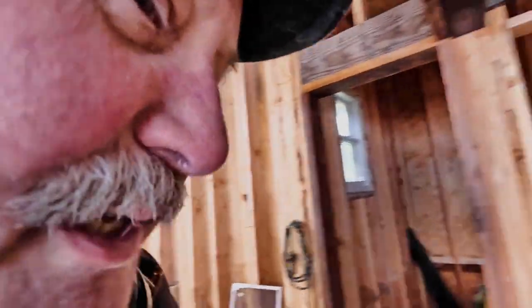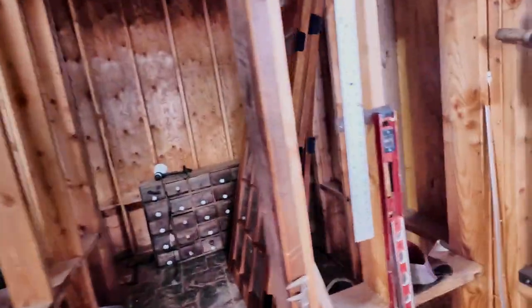And you have to do a very precise measurement. I'll show you where one comes up, because this comes up, if you can see it, it's dark in here. This conduit comes up right inside of a wall. So you had to lay it on the gravel precisely where it went. But then the concrete guys come in and put rebar down, and you're supposed to tie this to the rebar. And they didn't do that, for reasons I don't know.